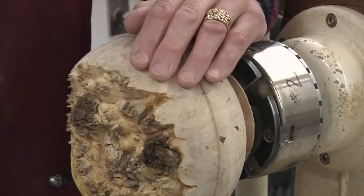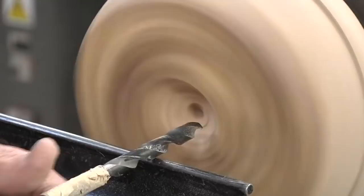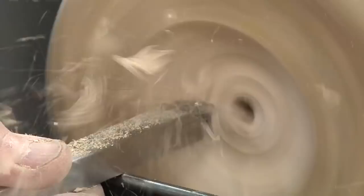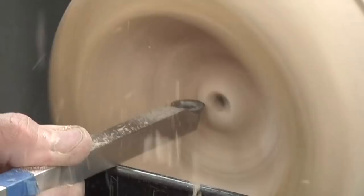I'm using a drill to remove the center. The Easy Wood Tool CIO round carbide cutter makes short work of removing the bulk of the wood. You can move the tool left to right or right to left — the main thing is to keep it flat on the tool rest with the cutting edge at center.